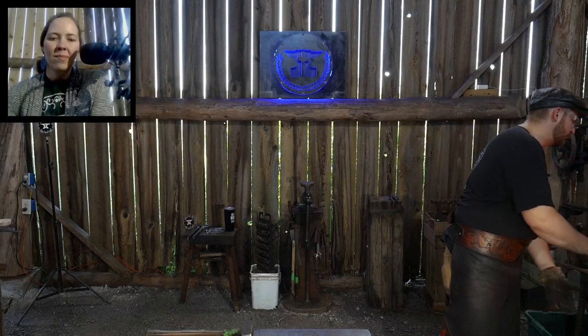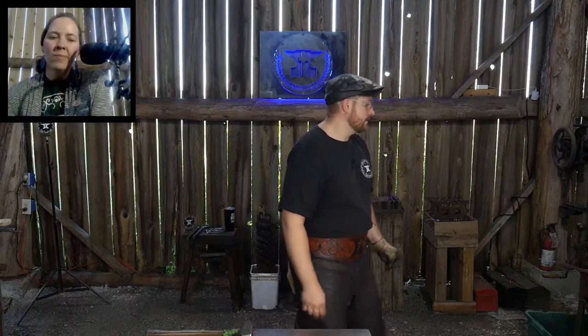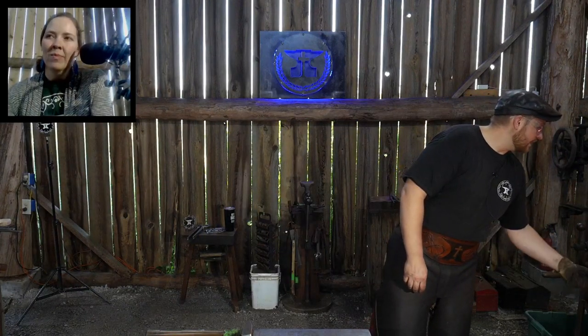But then you've got the guy in his garage in the middle of a cul-de-sac, and he can't have the noise associated with a 1,500 pound hammer. His neighbor's coffee jumps on the coffee table, right? He'll say, no, presses are the best. They're quiet, they're efficient. Both are true. You can get a power hammer, a press, coal, gas, or induction. It's whichever most benefits you in your particular forging situation and setup. That's what's going to be best at that point in time. As long as you keep that in mind when you're tool buying, you really can't go astray.